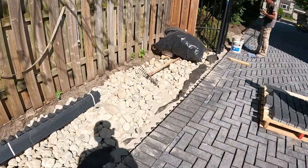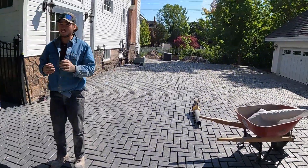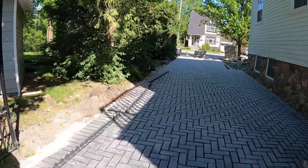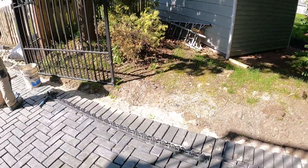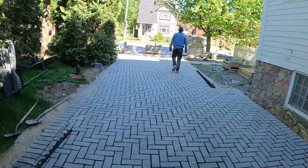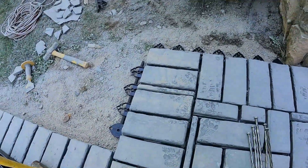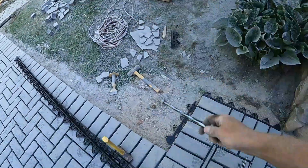Got her all in — Mark and I are putting some edging on. Hell of a base over there, man, swinging and swinging. Probably a little softer over here because we didn't have to go two feet deep. Pack it hard over here and you'll have trouble putting your spikes in for your edging. 10-inch Artyx spikes to hold the edging in all the way around.